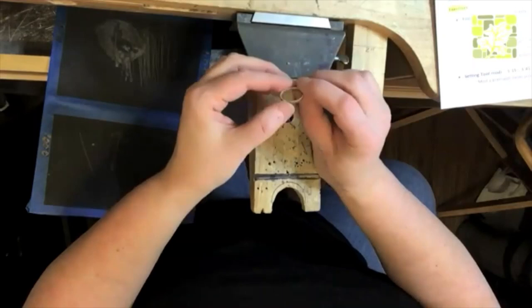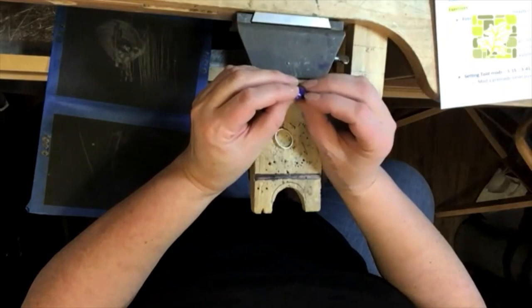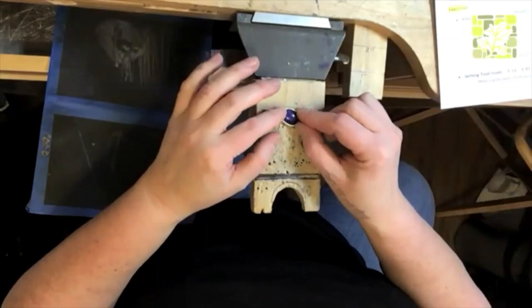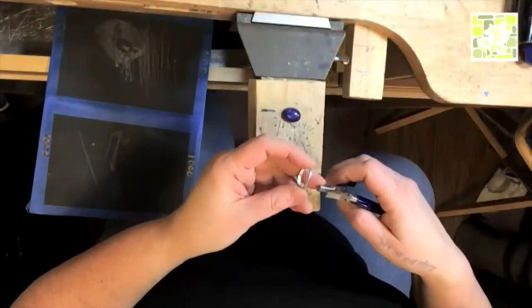We sawed out the strip at roughly the 1/4 mark, because as John points out, you want to be between 1/4 and 1/3 of the height of the stone. But with a heavier bezel, that can be down towards the smaller size, and with a lighter weight, you may want to go a little higher up the curve. So this is a very snug fit when we're doing this heavy gauge. I got as far as soldering it and doing a little bit of shaping and sizing. I'm going to remind you that John is in favor in the book of sizing up, always make it smaller rather than larger if you're going to err on the side of not perfect.